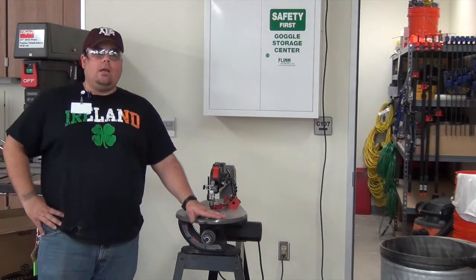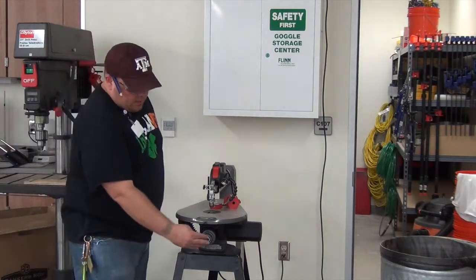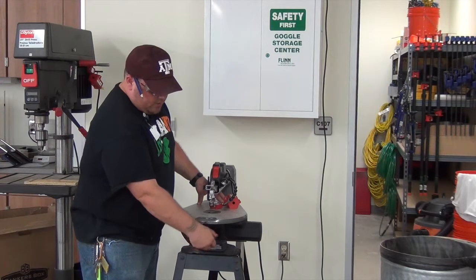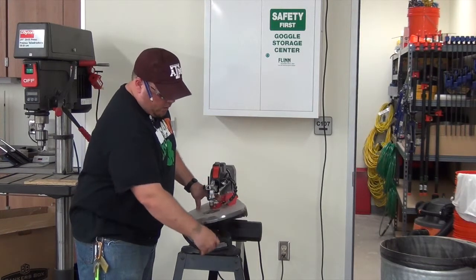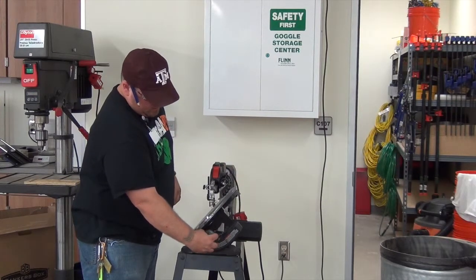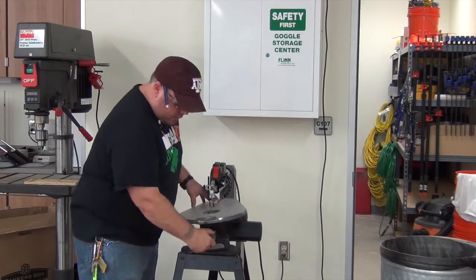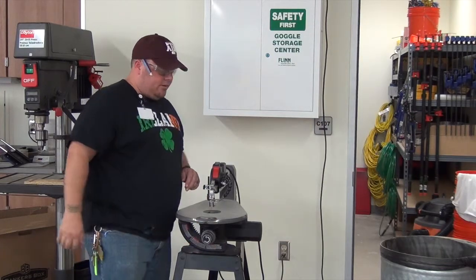This is a beveled saw, so we can control the angle of our deck in relation to the saw. We do that here with a stacked knob. The one that's furthest away from the saw is the locking knob, so we can turn that out, and then that's going to let us use the larger ring which controls the bevel of the saw. When we go one way, we only get to 15 degrees, but the other way goes all the way out to 45 degrees. Once we get it into our position, we want to make sure that we lock it in place. For our demonstration today, we're only going to look at that even cut, and we have an indicator window right here to make sure that we're at the right bevel. So we've locked that in place and everything's fine.